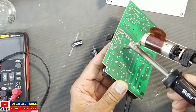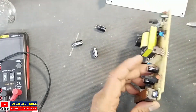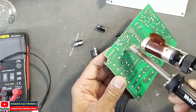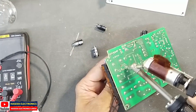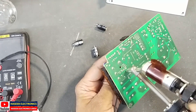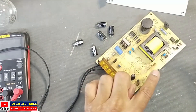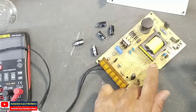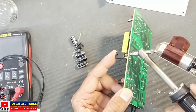All the capacitors are damaged, so no need to test them individually — when we see visible damage, these capacitors are expired. For more certainty, we also need to remove the rectifier, because the problem is in the secondary and it is the most suspected item. Let's remove it.